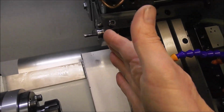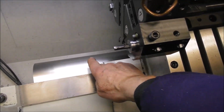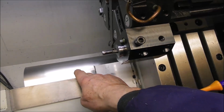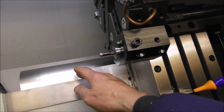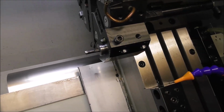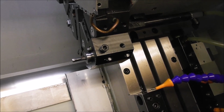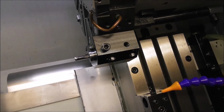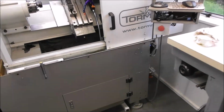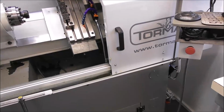And that's also the most difficult to recondition. How are you going to remachine that surface down the back there? You'd have to completely dismantle the lathe. It would be a major task. So another factor to consider is how valuable is that slideway, and a bed slideway on the lathe is often a very valuable slideway. I can imagine some of you are thinking, yes, but you've got internal lubrication,